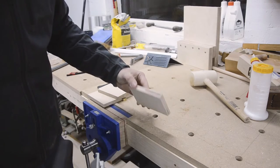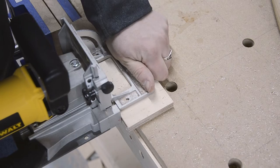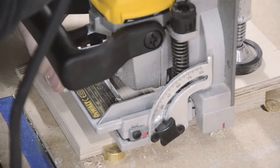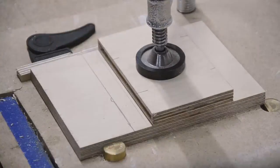The procedure is the same again. I mill into the edges simply once and offset in the surface left and right, so that the slot for the flat dowels becomes somewhat wider. So you still have some play when gluing and can move the parts back and forth a bit, so that it sits exactly flush at the end.